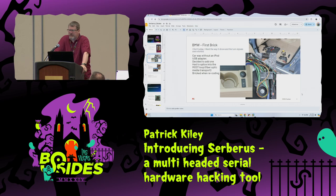You can see in the middle picture here, it has some fiber optic cables. The orange cable is the one that I had to add and splice into a fiber optic loop. That's called the MOST loop, for those automotive people out there. It's basically a multimedia loop designed to pass audio data. And I actually had to recode everything. It turns out the USB interface actually routed itself back to a telematics unit in the trunk, and then that spliced into the MOST loop, and then that MOST loop moved up to the head unit. But I figured it out.